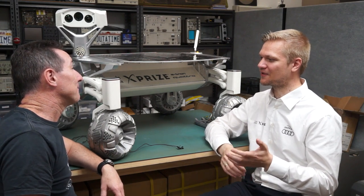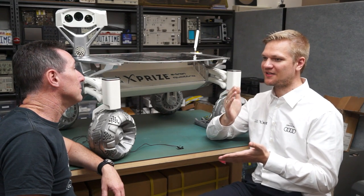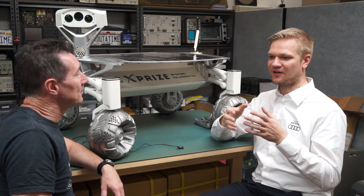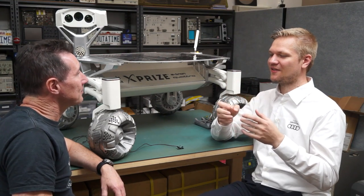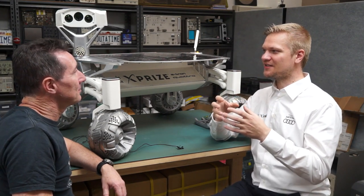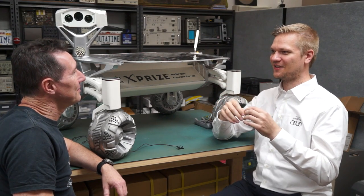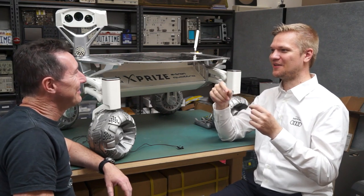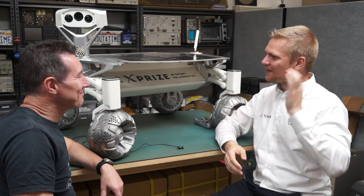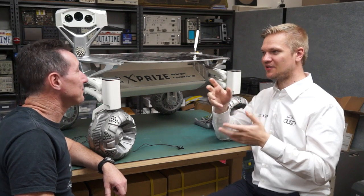This is one of the questions you have to deal with when you say, okay, let's make 3 CPUs. For example, for the lander, you might think that for the one controlling the engines we definitely need to have 3 of them. And then you realize this gets really tricky, because if you just do majority voting of the signal that controls the pulses for the thrusters, they might be shorter than what you need. This is where adding redundancy gets very tricky and you need to deal with all the failure states.